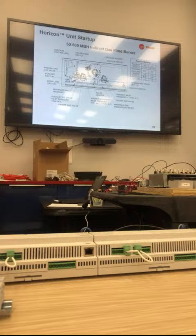That would require pressure transducers on the gas line and other things like that. But the increase in the minimum gas pressure should take care of a lot of the nuisance trips. That's what I've done to them. And the flame sense, which we're going to mention, we're finding is out of tolerance for where it should be on the burner. You're probably seeing a lot more this year. That's why I asked that earlier.